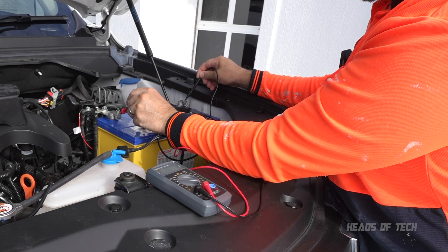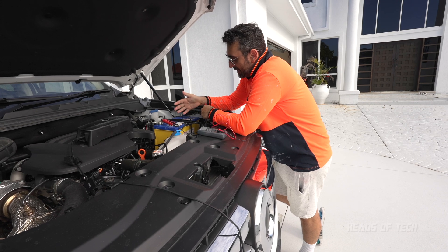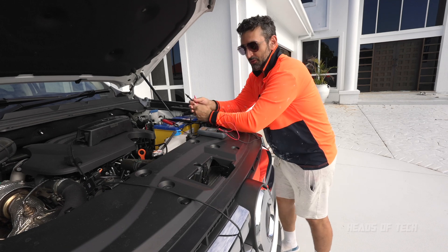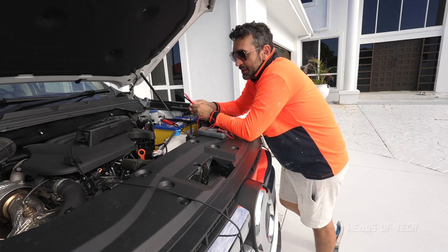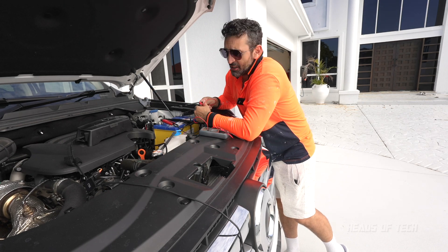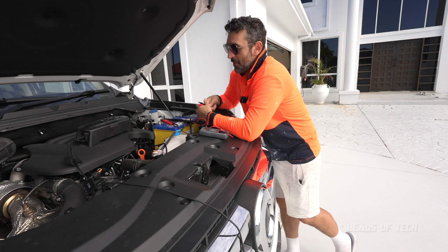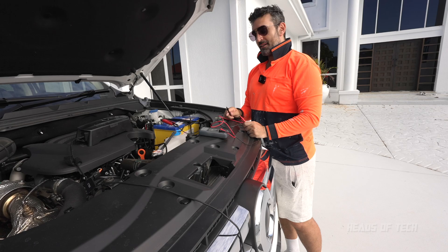It's now been another couple of hours. The battery has settled at 12.87 volts, so I'm guessing it's fully charged. I don't have a battery tester but the multimeter shows 12 volts — that's good. The actual CTEK charger is at minimum battery level but it's flashing to indicate the solar panel is still charging it. It should charge in about an hour because it's a 60 watt solar panel in ideal conditions — so 60 watts. It'll be interesting to see a longer test, maybe 24 hours.